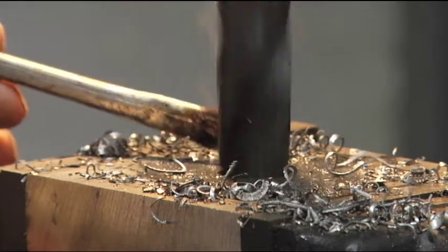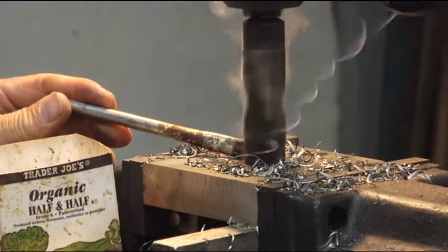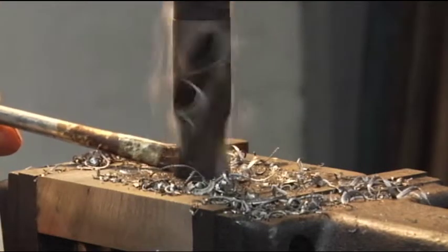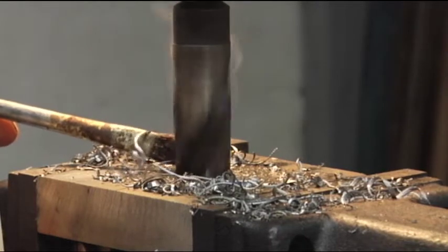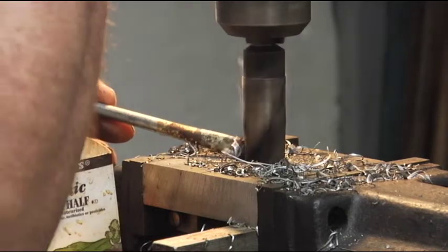Now we're going to go to our full diameter. If we try to drill this in one hole the drill will want to wobble and open the hole up to much greater than one inch, which would leave our jack screw pin loose in its registration hole. We're drill reaming this so that the hole will be very close to on size — we're only taking out a sixteenth of an inch, .062.